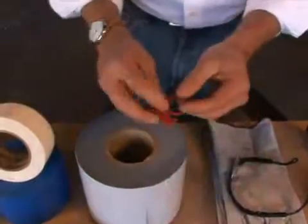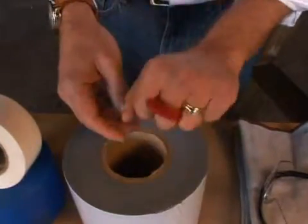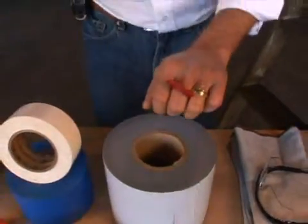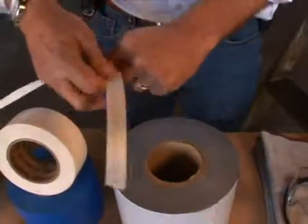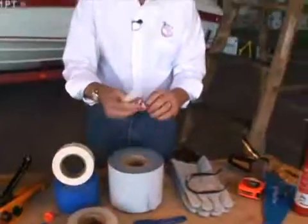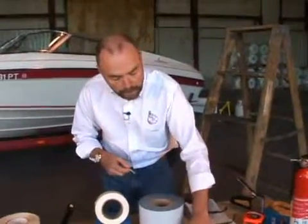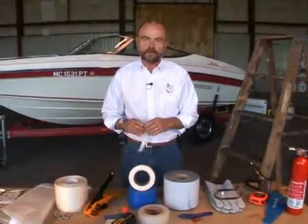And the last piece is our ring cutter. The ring cutter is worn basically as a ring, but it's used for cutting strapping. So you never have to pull out a safety knife. And you'll find when you're done with the job, you'll have fewer thumbs actually lying next to it when you're done. Now this comprises the whole system that you'll need to install a professional and very durable shrink wrap cover.